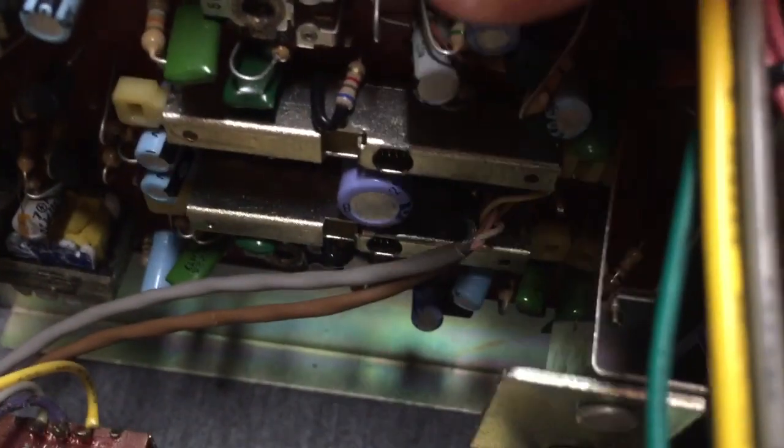And these switches really need to be cleaned if they haven't been, because again, static noise can come through, or you can be recording and only have the left channel or the right channel, or have static in one channel and no sound in the other. And that all happens via these two long switches here. So I took some contact cleaner spray and sprayed down inside of those to get those cleaned up.